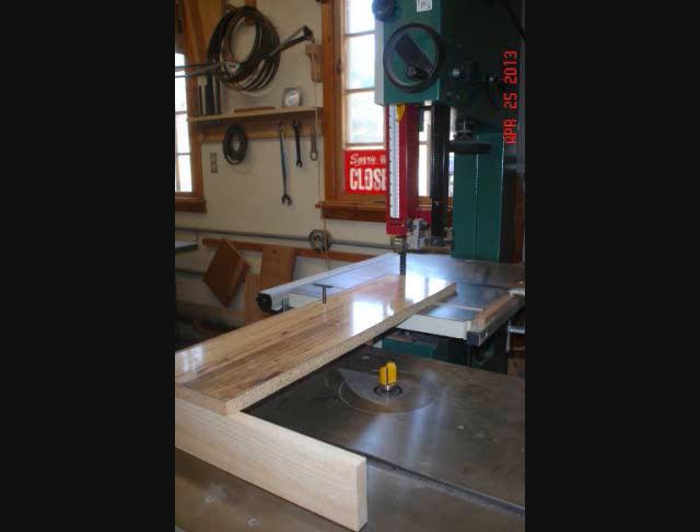The next job is to make a circle cutting jig for the bandsaw. I've established this board here to support the weight of the blank that I'm going to cut, and I've drilled a pin in it so that I can set the blank over that pin and rotate it. It's established at a 12-inch radius, and it's also set up so that the cutting edge of the blade is exactly tangent to the circle that we're going to cut. So the blank will fit down over this and we'll slide it into the bandsaw and rotate it, allowing us to cut a nice clean 24-inch circle.